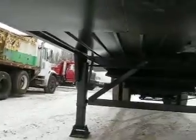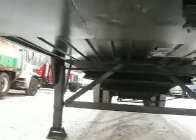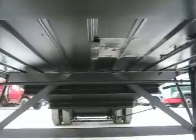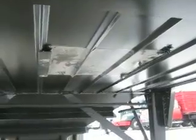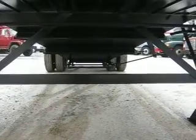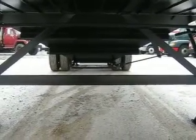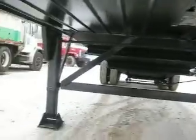Take a look underneath here, folks. You're going to see a thing that you don't see very often — we have floor panels over the wheels that keep all the garbage out of the trailer from going up inside and rusting it out. You can see here it is all sealed, and you can see where we have the hatch door — this is our access point to get up inside to paint and wire the trailer. Take a look at the heavy 2-speed 50,000-pound landing gears — you can unload this sucker when it's loaded. We have a real nice high-clearance hopper with about 22-inch ground clearance, and a real heavy-duty 2-stage door that's a double-track rack and pinion that cranks very nicely. We'll actually do a demonstration for you in a moment.